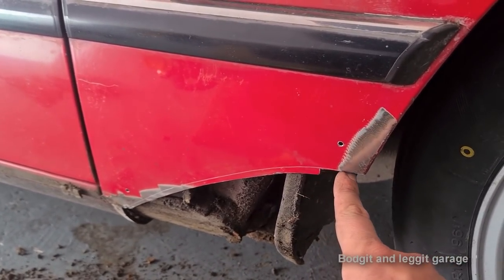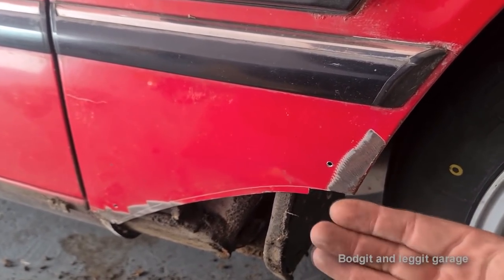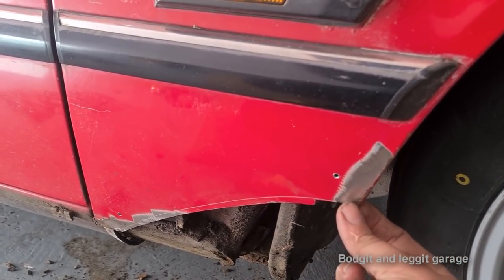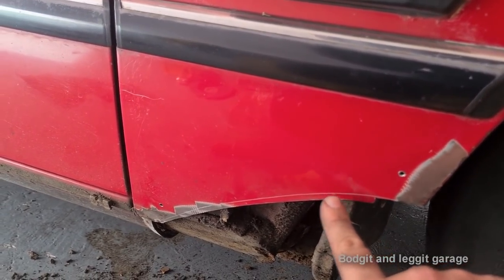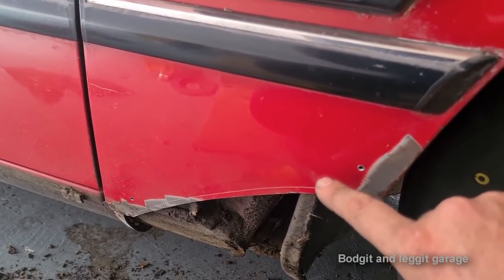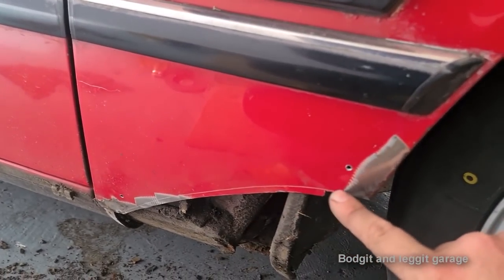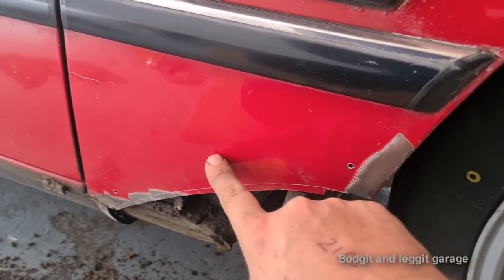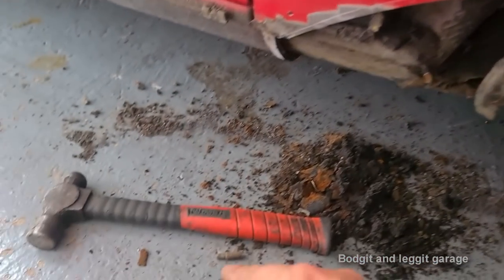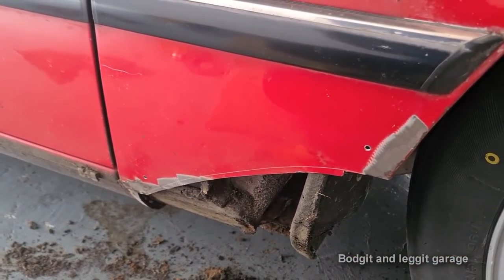Now I have taken this properly down, because if I leave that on, the panel's gonna stick out and also stick out forward this way. I need the panel to go down and in on the corner. So you can see my line here. The other good reason for doing this, because I'm following the curve of my panel and cutting this panel at the same time, I can actually cut any direction I want and get the perfect join. Where if you cut this and you're slightly off on your line, it's not going to line up very well on your panel. And the 1 mil cutting disc gives you a lovely 1 mil gap, which is what I prefer.